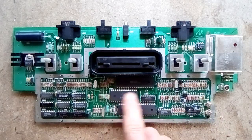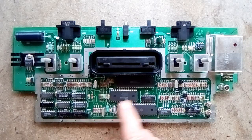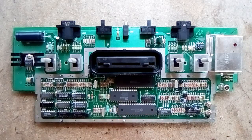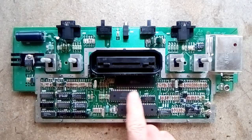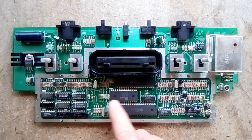This here is the same processor as in any Atari system — the 6507. It's the same processor that was used in the Nintendo Entertainment System and one or two others. It's a little brother of the 6502 that was used in the Commodore 64. The 6507 has 13 address lines, whereas the 6502 had 16, so it's a cut-down, less expensive chip. On the silicon level it's exactly the same on the inside, but some of the pins aren't connected, so you only end up with 13 address lines.